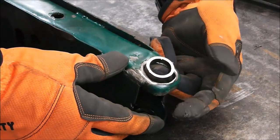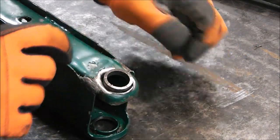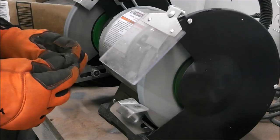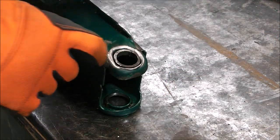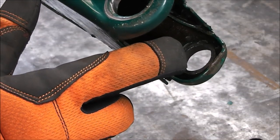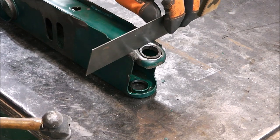All right, now that is going to go in here and get welded in. I'm going to push this in flush to this. Is this starting to make sense now? This quite doesn't fit through there, so I'm just going to put a little flat spot on each side of this just so I can get it to fit in - that's all I need to do. There - does that make sense now? Then we're going to weld this all the way around here. That simulates this hole now not being wallowed out, and then we will drill, after it's welded, the inside of that to accept this bushing. And you see how this now kind of looks like that? When it's all said and done, this new bushing that we make will look just like the original one. We're pretty close to it. We just got to tap this bushing so it sits nice and flat across that surface.